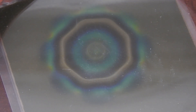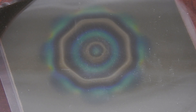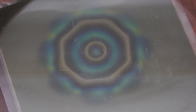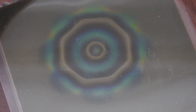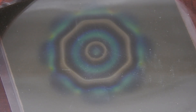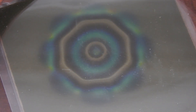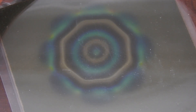Now this is a square wave signal at 4 Hz. And as you can see, the oscillation looks a bit different now. I will decrease the frequency to even lower frequencies of 1 Hz. So this is a 1 Hz square wave signal, and you can see it is more of a quick pulse than a slow fading oscillation. I will increase the frequency a bit more now — we are again at 4 Hz.